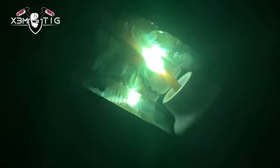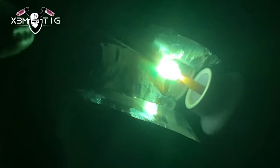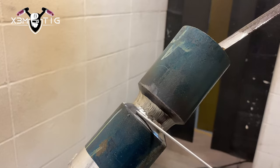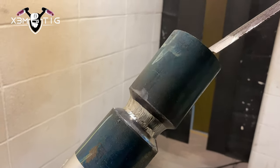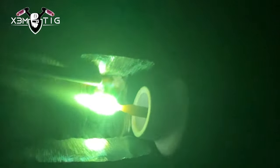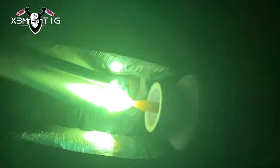Once you get to the wider area then you're gonna have to go like three passes, even four, depending. That puddle — it's not easy to manipulate. The impurity inside makes it hard to control. That's why it's a good habit to keep that rod constantly inside the puddle — try to keep it inside as much as you can. If you pull it out and put it back in, that connection is a little bit harder — every time you continue it's harder to establish that nice flow.